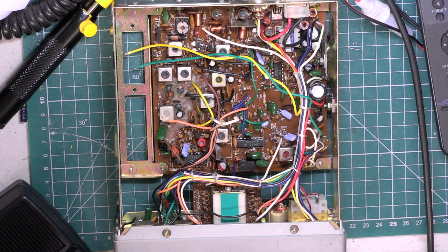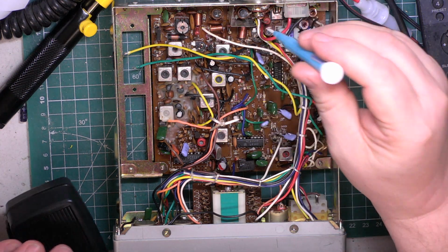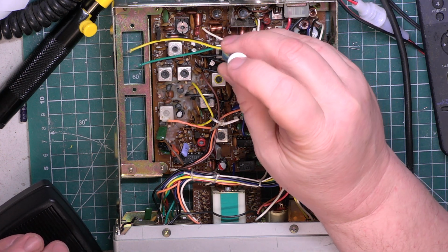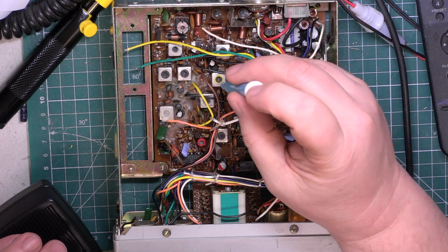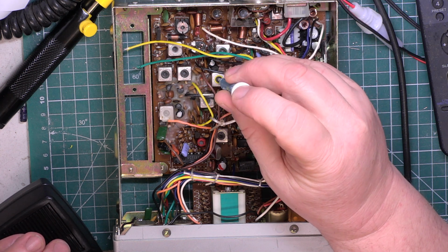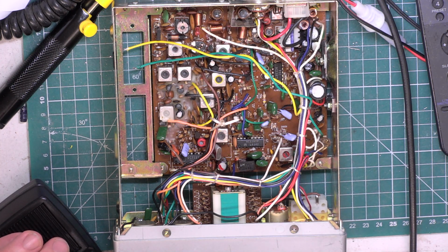We'll tune this. I want about 4 dB showing. The idea is you have your signal on your signal generator as low as is possible, so that it doesn't saturate the receiver. Because if you did that, you wouldn't be able to tune it. So, there we go. I'll just go through this front end. No difference there, so that was peak. Yes. We can drop the attenuator.